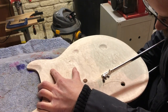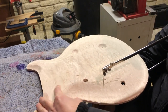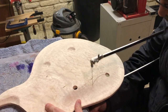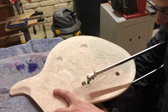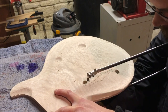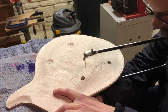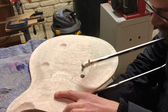The blade it came with was dreadful, so I just used one of my extra-fine 30-odd TPI inlay blades and that worked absolutely fine. The double cut shape is quite wide so that worked a treat — I'll stick the eBay link in the description. I've done a few of these builds and used a little fret saw and it was a nightmare having to turn the thing around on its side and trying to cut around it; you end up being miles away from the line. This got me nice and close to the line.